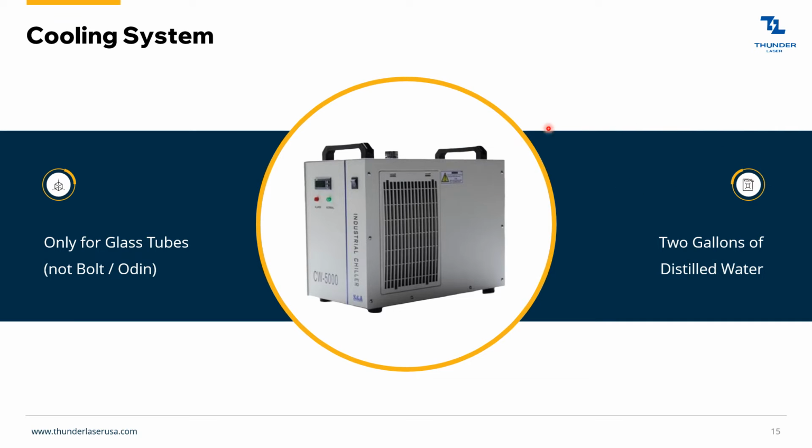And as that laser tube heats up, it's getting hot, and this cold water that's being circulated around it is keeping it cold. And that helps with a lot of things. It also helps with the laser tube life. It's super important, but really there's nothing to know. You just put the water in there and the machine will tell you if it's not on. So if you ever forget to turn it on, it's not going to let you run anything. And again, this is only for our glass tubes, not our RF tubes on Bolt or Odin.